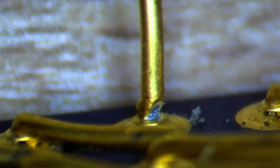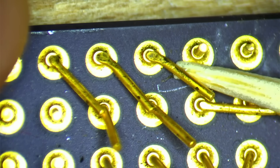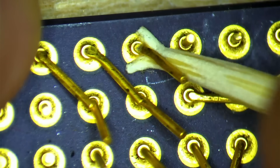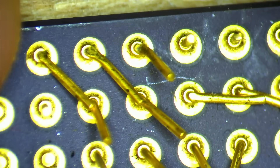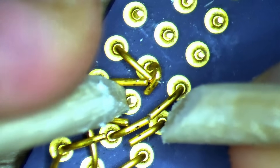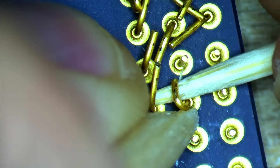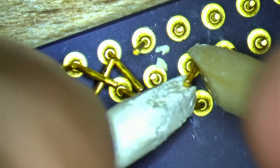We now get a good look at the silver core of the pin. I guess this will not be the last one, considering the condition of the other pins in this area. Of course, we cannot leave partially cracked pins like this, because the exposed metal may be susceptible to corrosion. When we are done with this CPU, we should reinforce those fractures with solder — this will not only protect the exposed metal but also reinforce the pin. But those fractured pins are not the only challenge. Some pins have multiple twists, and others have been shaped into something that closely resembles a hook.